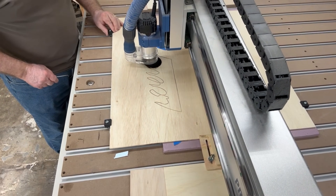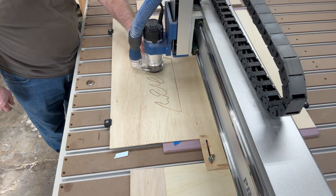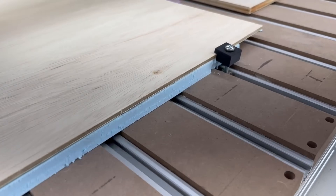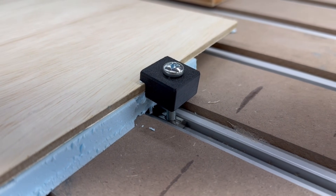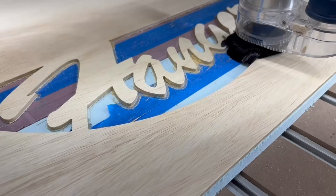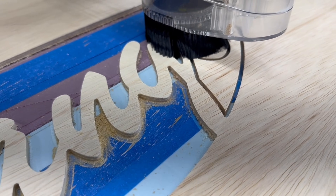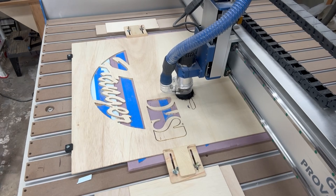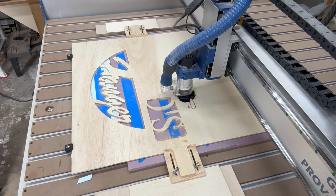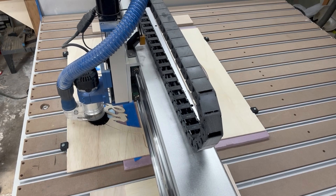The next question is how do I hold this project down? Because there are so many little details and pieces that have to be held in place, and I do not use tabs, I'm using the glue and tape method. In addition to that, because of the size of the project, I'm using these plastic 3D printed clamps and the bump stops. The cut is very clean, so there's going to be very little sanding required. Because this sign is so big, I can start cleanup while it's cutting other sections by lifting up pieces that are already cut with a pick.